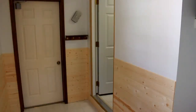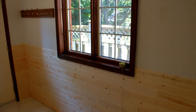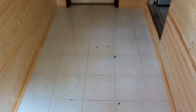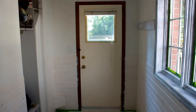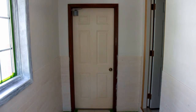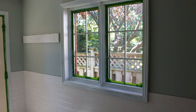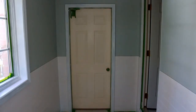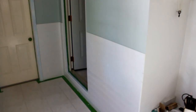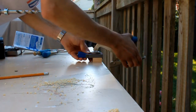Look how nice everything looks! I cut my shoe moldings using quarter-round finger-joined pine. I primed all the pine with shellac primer — it's the only thing that'll seal the knots. Watch carefully, you'll notice a color transformation even though the chair rail has yet to be installed. I thought it would be easier to pre-paint all the chair rail and shoe moldings before installation, and wouldn't you know it, I was right.